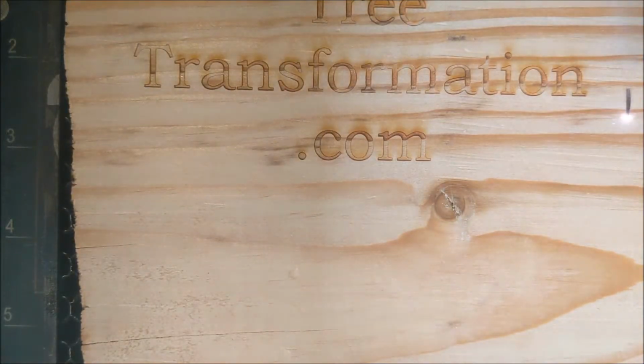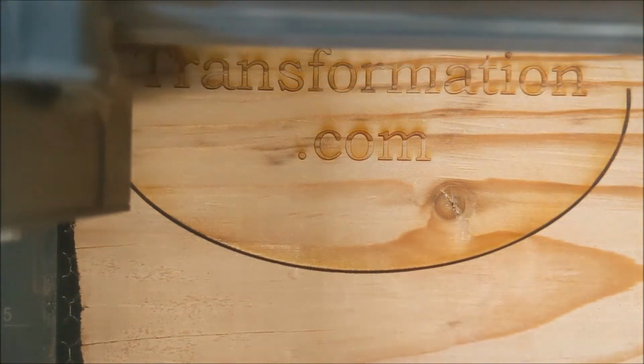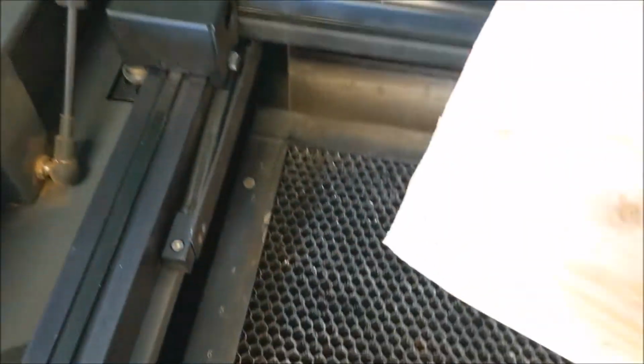Okay, here's the laser cutting out that little wood inset. It's a piece of fir, planed down about 0.28. That was the engrave, and now that's cut through right there. I think it's cutting all the way through from the looks of it. Cut all the way through. It's pretty good. Yep, just barely cut all the way through.